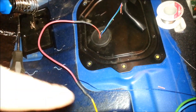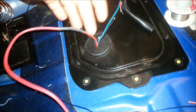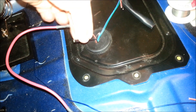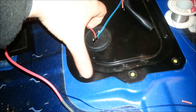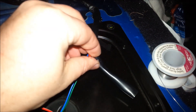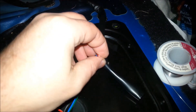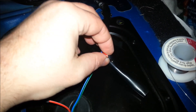Because of where I'm mounting the relay, I had to make a little bit of an extension, which is no big deal. You can see here the white and red is where I clipped, clipped close to the pump. And here's the black — this is going to go ground to chassis. We're not going to use these bolts or these screws because they're plastic lined. These two here: this is power from the factory relay, and this is just a ground to chassis. This isn't a very good ground for the pump considering we've just given it a whole lot more current.